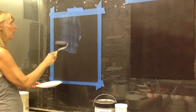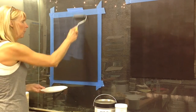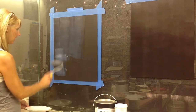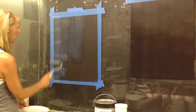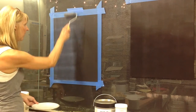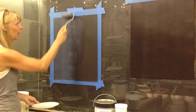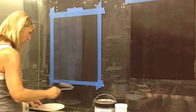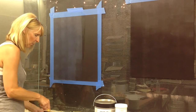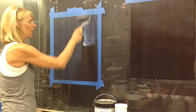So, I'm just going to roll this on the complete surface and get my sample board ready for the technique that I'm going to show you. As it goes on, it looks kind of white and milky, but it will dry out completely clear. You want to make sure that you have 100% coverage. No adhesive, no tack, no transfer. So, you don't want to have it dripping off your wall, but you definitely want to make sure that you have 100% coverage.